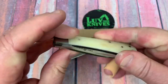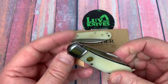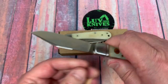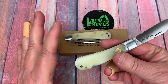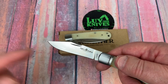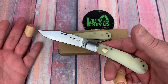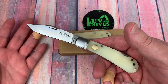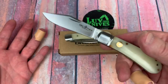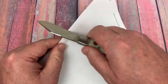The 1508 is a slip joint and the 1509 is a lock back. I actually like the 09 better because of the lock back. The handle shapes are very similar but the blade shape is more to my liking on the 09. It's got a nail nick and a little choil area. The steel is VG-10 — we've had them checked. We had a Brother Knives D2 model check out at 60.5 HRC, and the VG-10 came in right at 58, which is fine for VG-10.